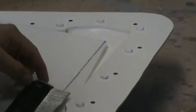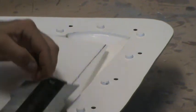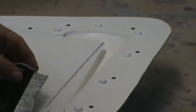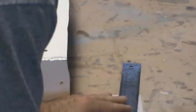Then just take a contour gauge. Take a contour of it. And I set it up to this tip back here, over just a little bit, so I know exactly where to put it on the foam. Then line up the two. Make your line there, and what you end up with is a copy of it. Again, this foam is extremely hard and dense, so I don't use number 11 X-Actos. I actually use a straight box cutter because it's the only thing you can reuse. The number 11 X-Acto, you'll literally make one or two cuts with it, and the blade's dull. It's done with.